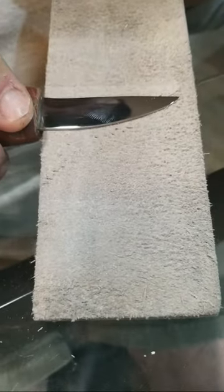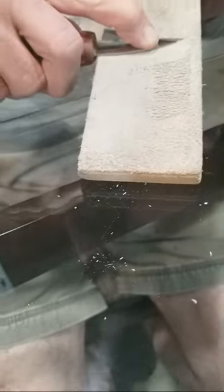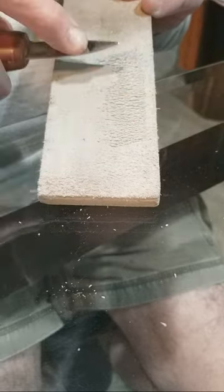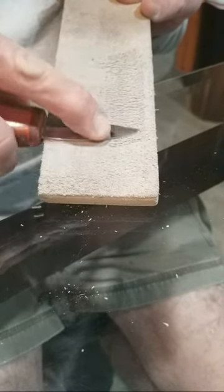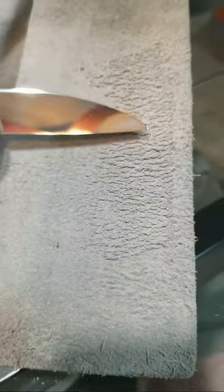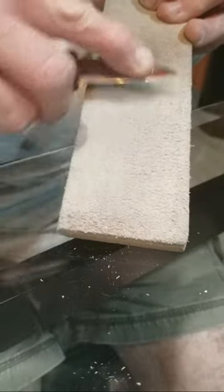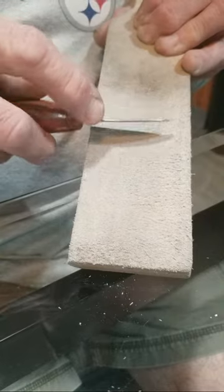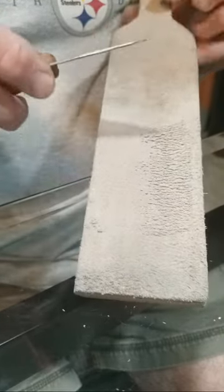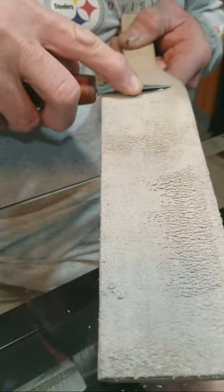Now the cutting edge is facing me. I'm going to put it flat, tilt it, and go away from myself. You don't want to go this way — you'll cut into that leather and ruin your strop. You probably can see a little shiny piece right there. You do have some metal that comes off in here. Yeah, you can see some sparkle because the light's so good in here — the blade's shining too. So we'll go back this way, and then I'm going to turn it over one more time and go this direction. If I have any excess compound, I'll clean it off up here where there's no compound on the strop.